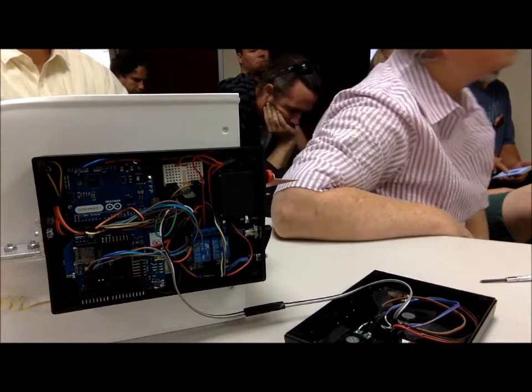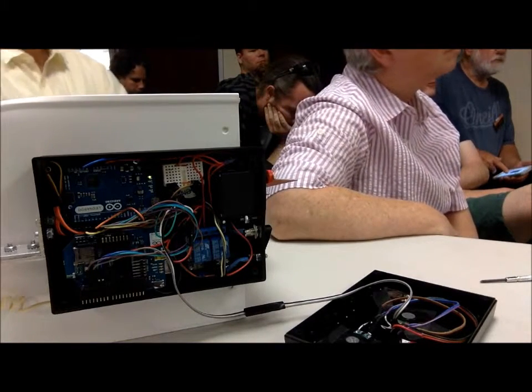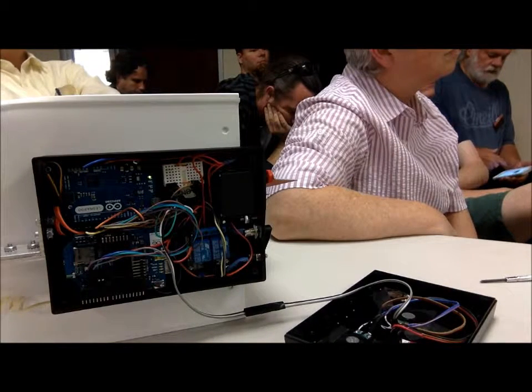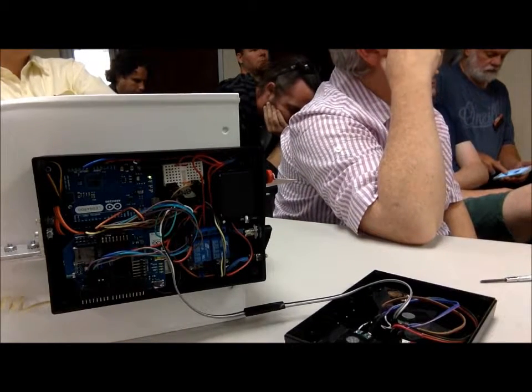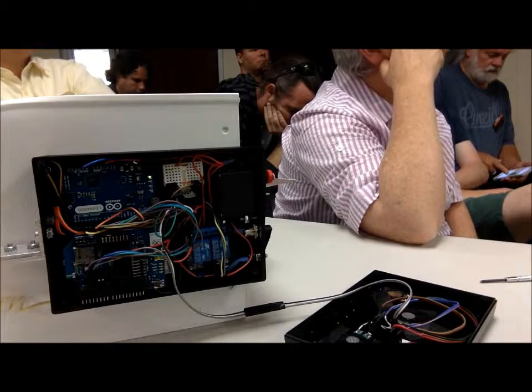I don't want to have to mess with batteries all the time. 4 AA batteries for a year. So I set up the basic Arduino. I had it working with the basic stuff, operating the servo and doing basic things, not the talking, just the basic things. And I measured the power usage, and those 4 AA batteries would last for 24 hours.